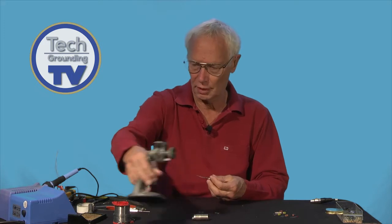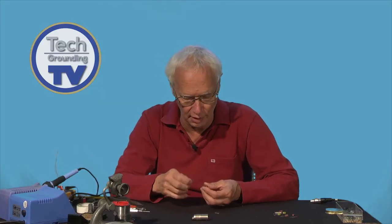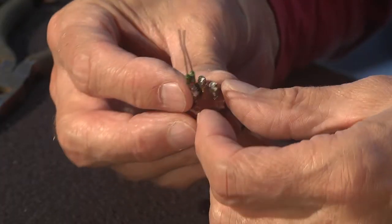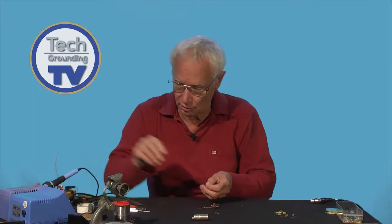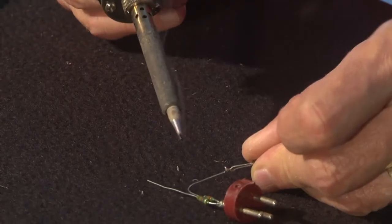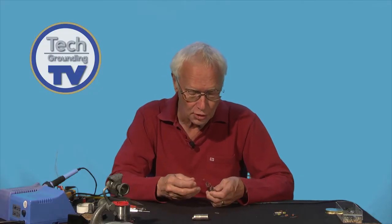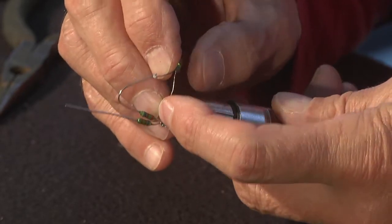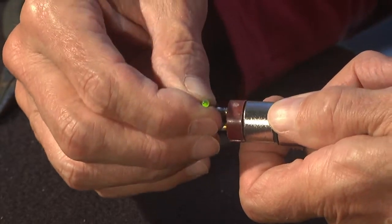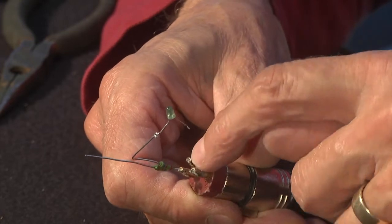Because I'm lazy, I've got to find out which way to connect these LEDs, because they are diodes and they won't light up unless they're connected the right way around to the supply. As we know, negative is on pin one and the phantom power positive is on pins two and three. So I'm going to solder on one of my LEDs and check which way around it's supposed to be connected. I've got a source of phantom power here from the mixer. So if I pop it on to pin two... yes it does, it lights up. And also pin three, it lights up. So that's the right way around to connect it, which is handy.